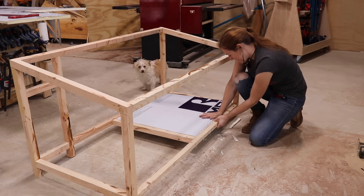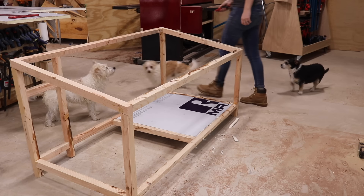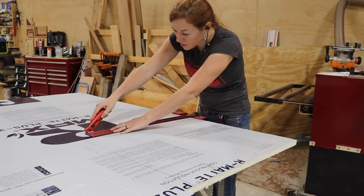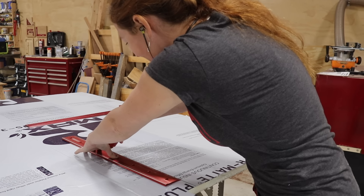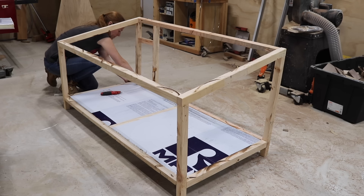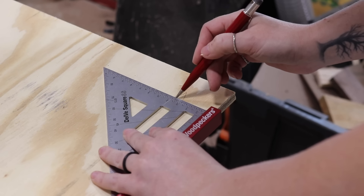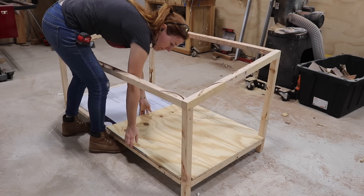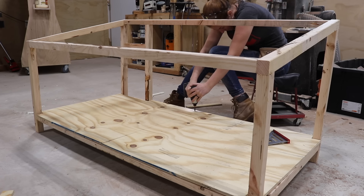Next up was the floor, but before putting in the decking material I threw in some insulation. This comes in big four-by-eight sheets and is only three-quarters of an inch thick. Since my framing is one-and-a-half inches thick, I cut two panels per opening and doubled up to fill the cavity. I used a straight edge and a box blade or pocket knife to cut it out and stick it in place. Once the bottom was full, I measured and cut some plywood to deck it — I cut the piece in half to make installation easier, making sure to cut it in the center so the seam joined to a floor joist.